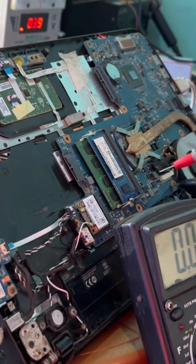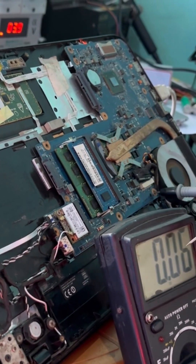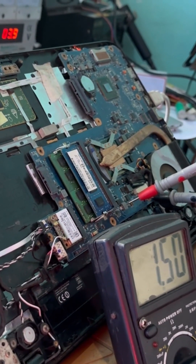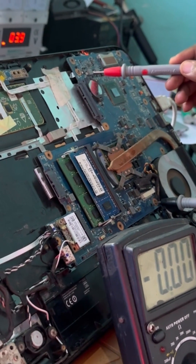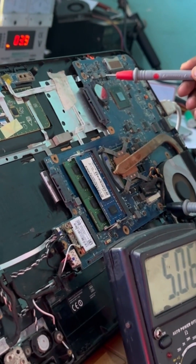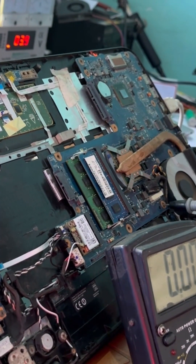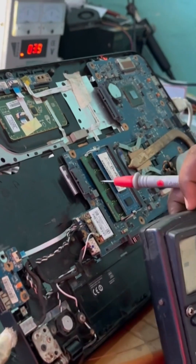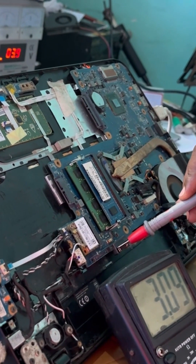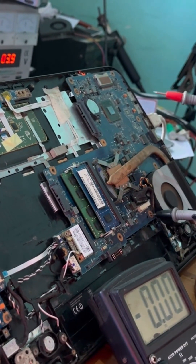In the schematic, around 1.5 volts — that's okay. And 3.3 volts near the EEPROM, yeah that's fine. 5 volts for USB-C, all is fine. And again, checking the battery outlet and charging outlet — that's 3 volts. It's good.